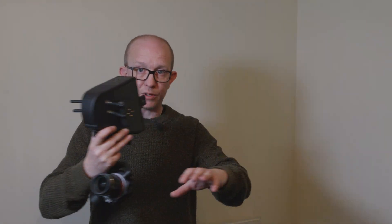In low power mode it still stabilizes, still functions, and you can control it just the same as normal. But when you're moving it — either car mounted or on a drone — when you hit about 80 kilometres an hour you'll start seeing some shakes where the gimbal just doesn't have enough power to stabilize. So it's limited to about 80 km/h, whereas the original Pandora could go 170–180 km/h and still stabilize perfectly. That's its only real limitation; otherwise it functions the same as the normal gimbal system on the Inspire 3.